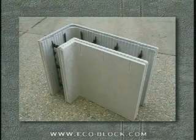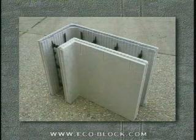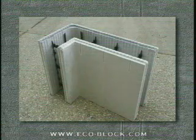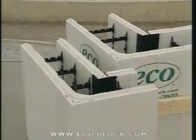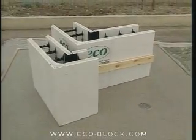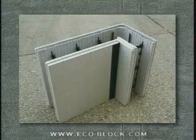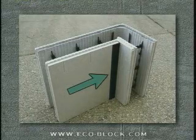In the 24-inch commercial panel system, 90-degree corner blocks are manufactured to build forms with 6-inch or 8-inch concrete core thicknesses. For other form sizes, left and right outside 90-degree corner panels are bundled without matching inside panels. The inside panels are fabricated on site using a 90-degree corner connector.